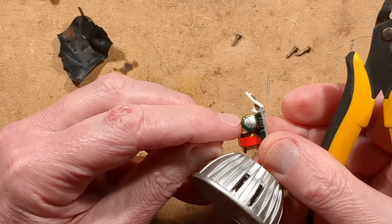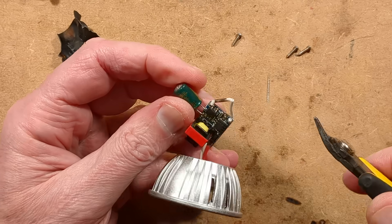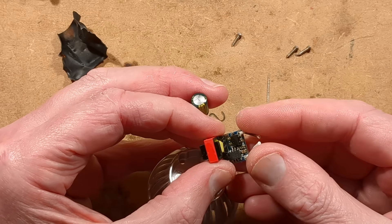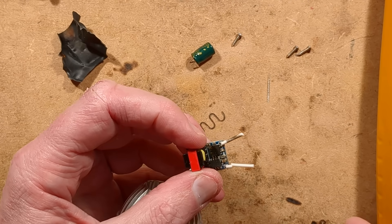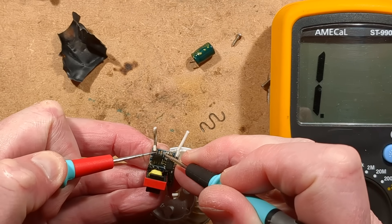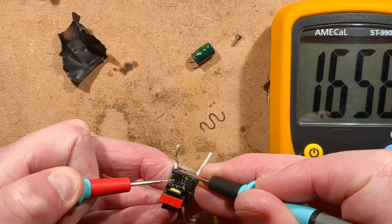Big skidmark — it has gone with a bang. That's where it would be useful if they had the little fusible resistor. Let's probe the bridge rectifier and see if it has died in a short circuit manner. Let's go across the two input connections. It's not dead short circuit on the input — oh, that is. It's short circuit. The rectifier has failed; one of the diodes has failed in it.